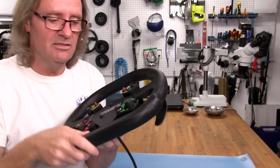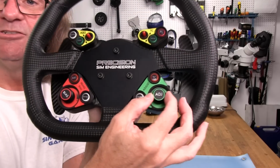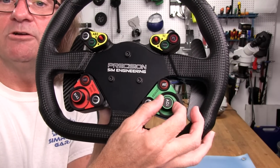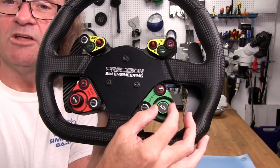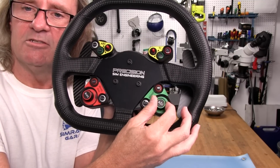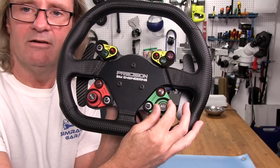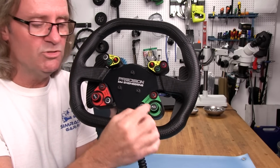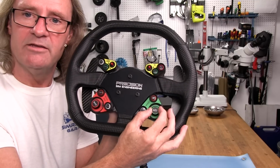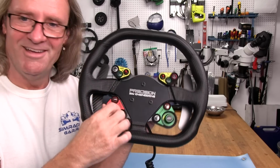Well, these are, like I said, hands down the best I've had, and I'm going to try to find out who manufactures these, because the indentations are good spacing. There's the 1, 2. You can see how far it's turning when you turn it. So you can do 1, 2, 3 real quick and know exactly where it is. Not only that, but you can feel the tactile feedback you're getting from that indentation, or that detent, is just great. You know exactly what you're doing. There's no guessing here. And again, very stiff shaft, so the tolerances between the bushing and the shaft that goes back into the actual rotary's body back there is very, very tight. And very close. Just great stuff here. I really like this, as you can tell.